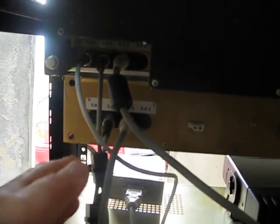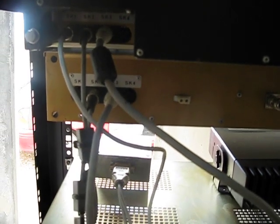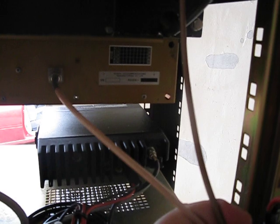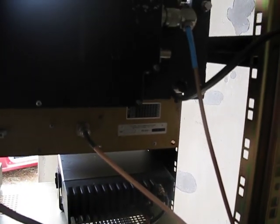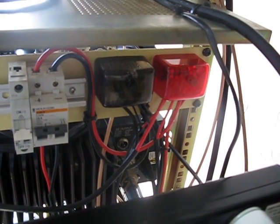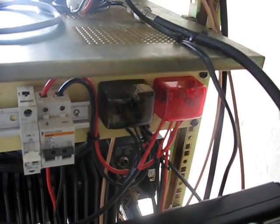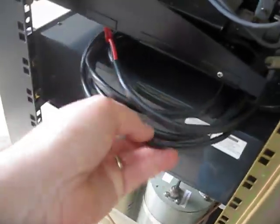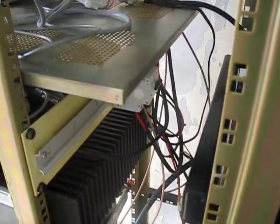Let's head around to the back of the rack. Philips traditionally used DIN connectors, so we've got a lot of 6-pin 270-degree DIN connectors in the back of the radio equipment for interfacing, and RG400 coax for RF in and out to the duplexer. You can see our very basic DC distribution here — one of these days I'll upgrade this. I've got plans to put an Anderson PowerPole distribution system in. The repeater already plugs in via Anderson PowerPole, and I'd like to do it with the rest of the equipment — very convenient with good solid connections.